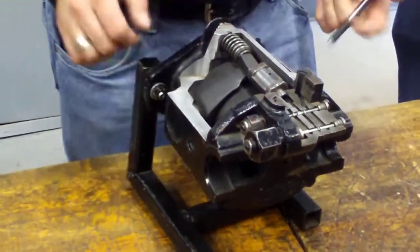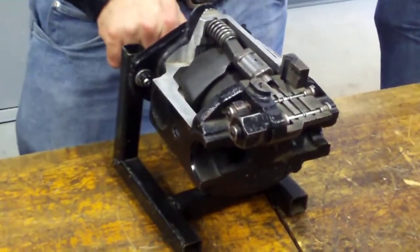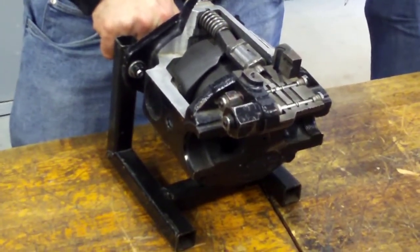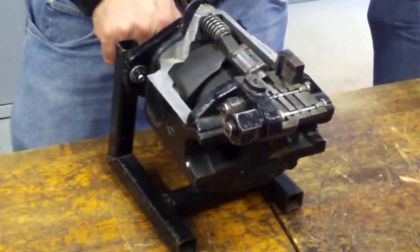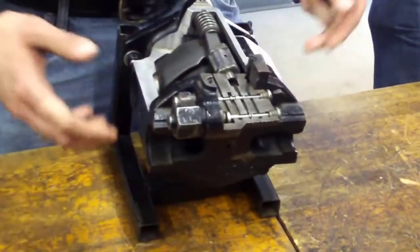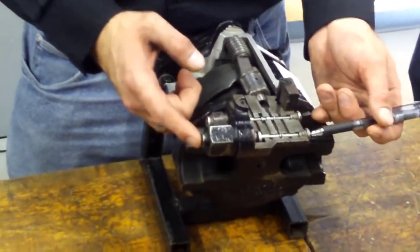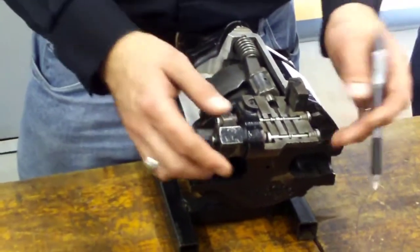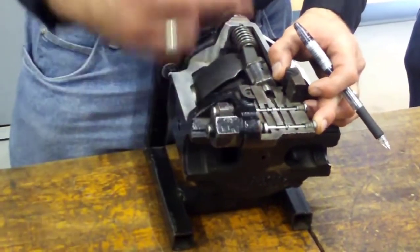When we first fire up, the output pressure goes up to all the valve stacks. Given that this is going to be used on a closed center system, that means everything is dead-headed, so as soon as that pressure starts to build up, this pump is basically going to turn itself off. Down here we have a load sense spool and a pressure compensator spool. The pressure compensator is the one that will shut the pump off at peak pressure.